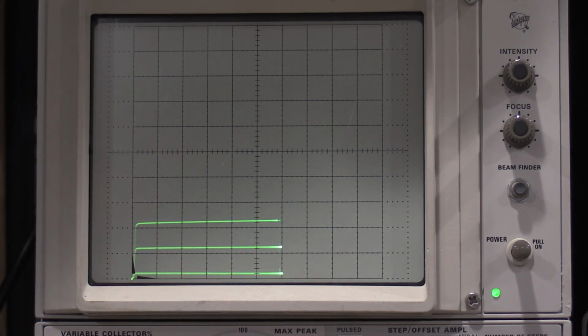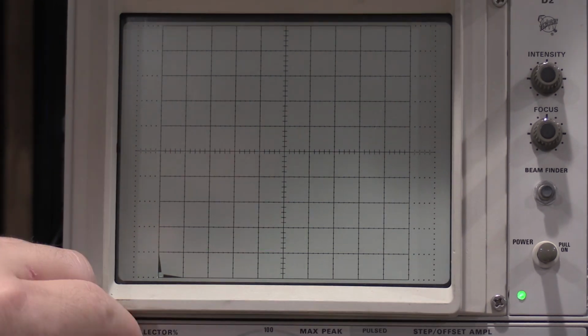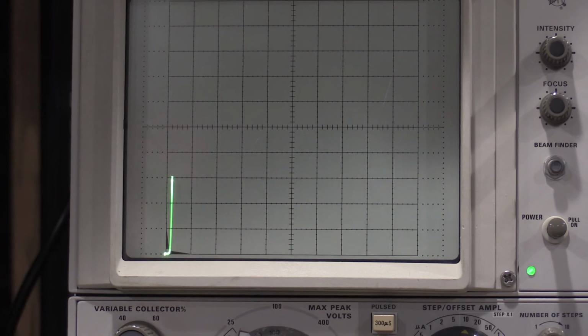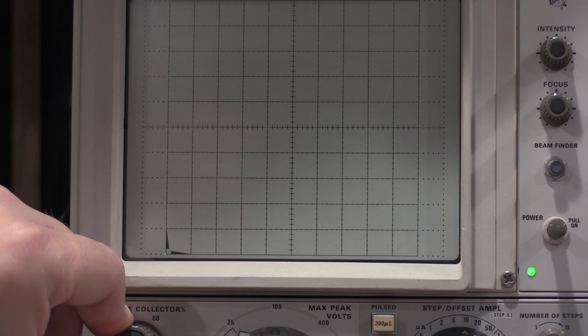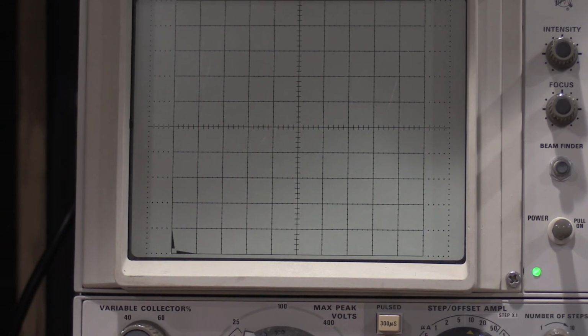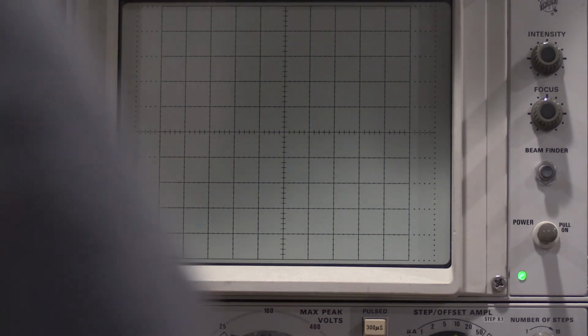So what I'll do now is get one of those power diodes, and let's see what the breakdown voltage is in that power diode. Okay, so I got the power diode hooked up down there, and this tells us that I hooked it up the correct way. So we're forward biasing the diode, so we turn on very quickly, and then we just have a short circuit. So what I need to do is turn the diode around, and we're going to do some breakdown voltage.